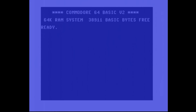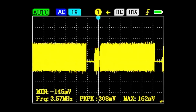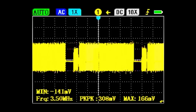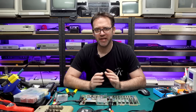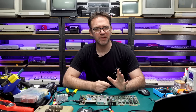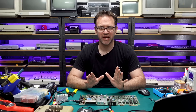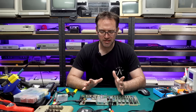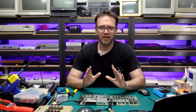Oh yes — look at that, that looks fantastic! Checking the voltage levels, we're seeing almost spot-on 300 millivolts peak-to-peak, which is perfect for S-Video. So now we have a pretty decent composite video output and also a very nice S-Video output from this original Rev-A board. Didn't have to cut any traces — we literally just added three resistors, and it's all reversible. I'm pretty happy with that.